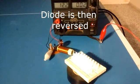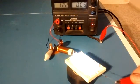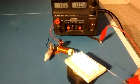I've reversed the diode now just to see if it's any different. The primary frequency of this circuit is in the order of 6 MHz, and the diode is rated up to 100 MHz, so it's not the frequency of the circuit that's causing the problem here.